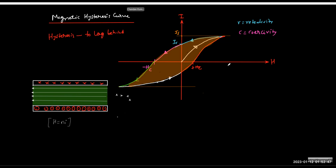What they do is use a giant electromagnet in which they send current and it becomes a really powerful magnet. What you apply is a small field, but what it becomes is a very powerful field because it's a ferromagnetic substance. We generally use iron. This is called an electromagnet. By sending current, you create a powerful electromagnet which you can stick to the container. You will move to the destination and try to drop it. To drop it, what will you do? You will stop the current, isn't it?